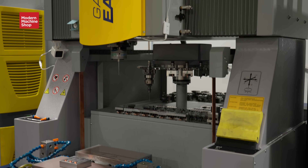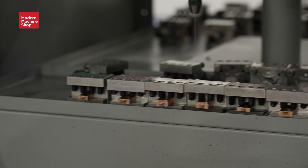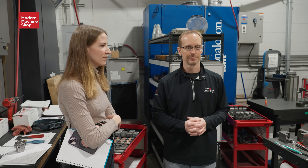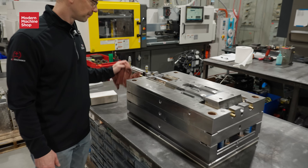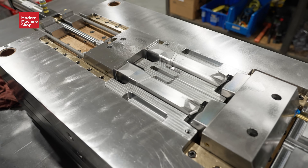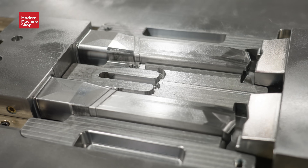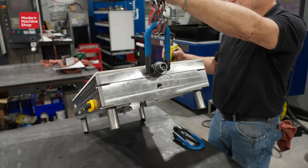Not only do we make molds, but we also do EDM outsourcing where people bring something complicated or need a bigger machine, so we do a lot of EDM work for other companies. That's been a good avenue — if we're slow in one area we have a couple different ways to keep everyone busy. Here's an example of a mold we just finished for the Shot Show: it's a two-cavity Glock magazine with hydraulic slide and mechanical slide. This will go to the customer and they'll mold it at their facility; we'll do the sample run here.